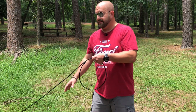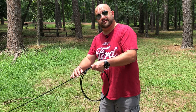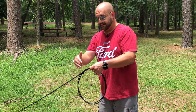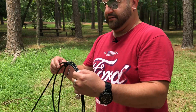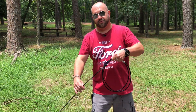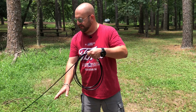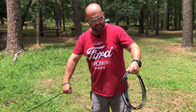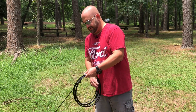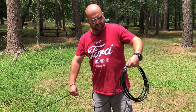We're going to start by making our first twist overhand. Then we reach underneath the coaxial cable and grab it and make a twist underneath. So the first one was over, the second one is under. You can see how this is underneath now. Then we're going to go back and make an overhand turn, and you kind of are twisting it with your fingers a little bit, but then we go back underhand and bring it underneath. And then back over, under, and continue until your coax is wound.